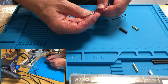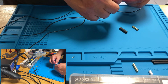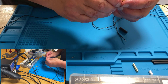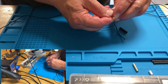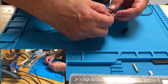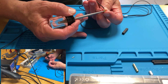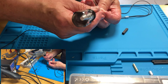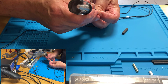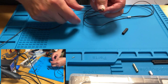Let's put our crimping loop sleeve on first, get it far out of the way. Now on the male end of this connector — they have one too. There's a little hole here that we're going to try to feed the wire through, and it did. We're going to do what we did last time. I took the awl and just worked this wire down into the cavity until I had all the wire in there. That way, when we get that big pool of solder in there, there's a sufficient amount of wire to hold it in place, and then we trim off this excess wire on the outside. Helping hands — be back to you in a second. Same thing as last time, let's get our gun up to temp.